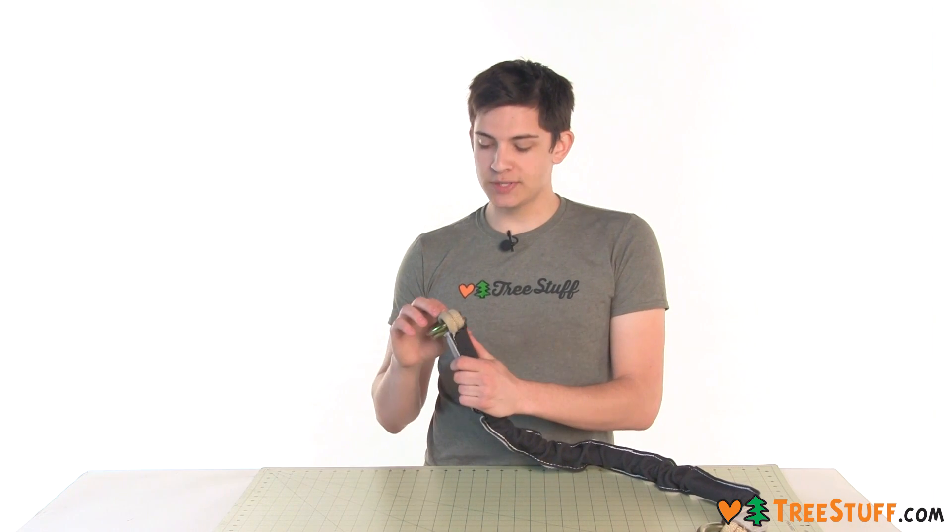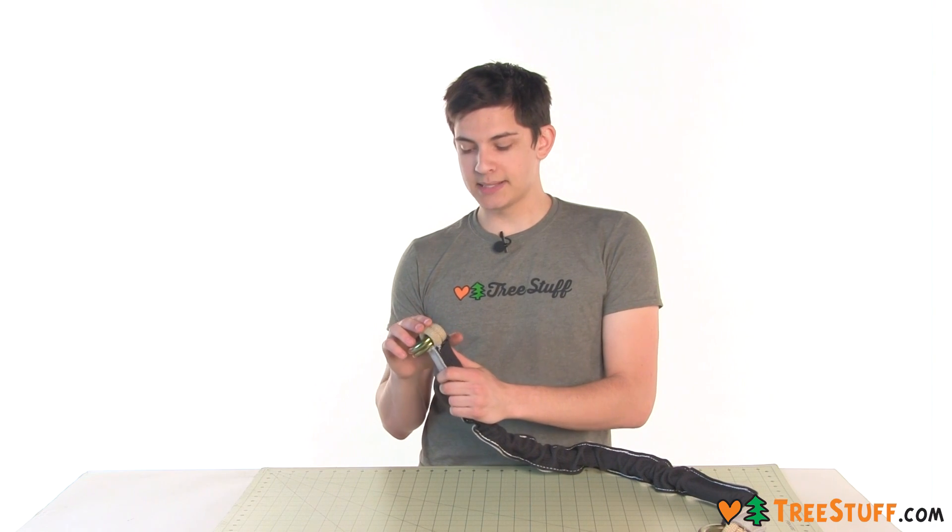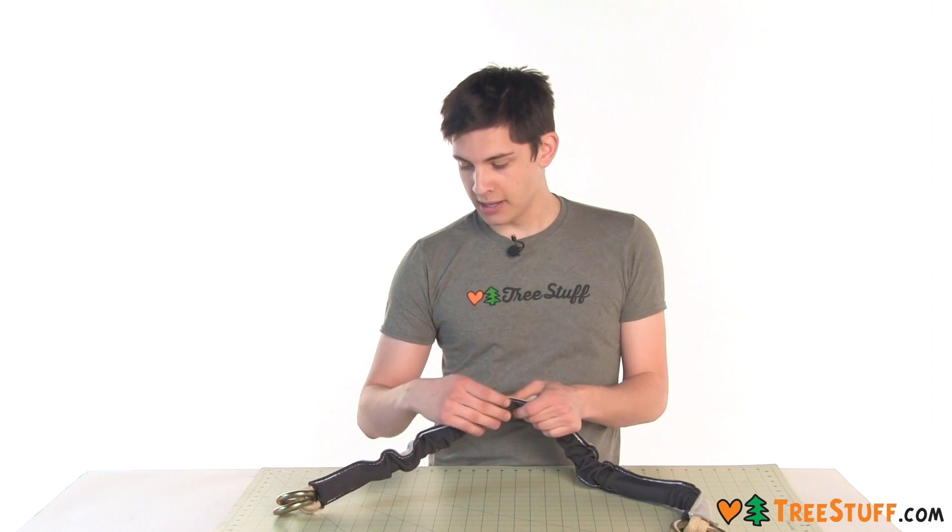This sling uses two separate strands of Sterling Tri-Tech cut resistant cordage and it's got all-gear heavy-duty chafe on here. This stuff is really thick and really strong, and really helps to resist the wear on your crane cable. It's also got three high-quality forged steel rings.